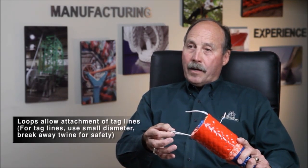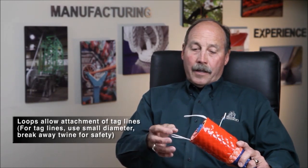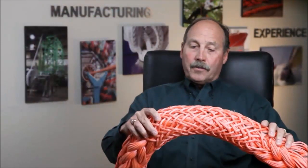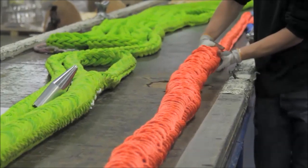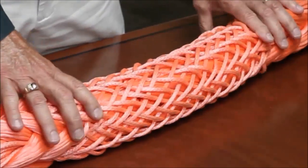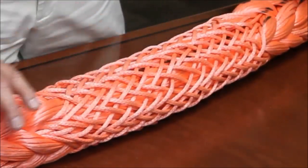In the case of some of these mooring lines, we feel that the new DC MoorGuard with the new connections we've put on here — so that you can put your tag line on with any small diameter to protect the crew, or have a breakaway with a small diameter like polypropylene or manila — allows your line to deploy through it very easily with ultimate protection. The Dynalene is a woven product that looks snaggable, but we find that after the customer uses it and the constructional elongation — which is about 4% — gets taken out, it actually lays down and becomes an integral part of the rope. We've actually had compliments from captains saying the Dynalene has really performed well.